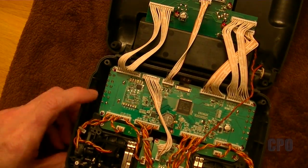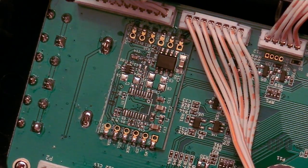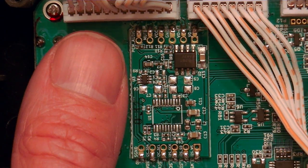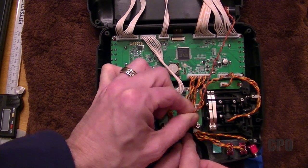I'm also laying down a blanket to protect the front switches, buttons, and sticks when they're laying on the table. Once you get it all split apart, just spread it out and lay it all out. What we're looking at is the side where the sticks are. The back side of that board has the daughterboard for the audio on the Revision A — it's really small, actually smaller than I imagined. Here you can see it compared to my thumb to get a sense of how small it really is. I also have the factory speaker still in — I want to make sure all the mods are done with the factory speaker.